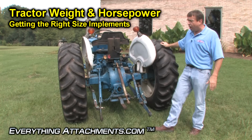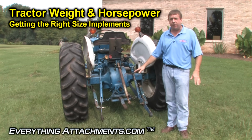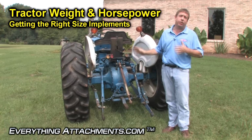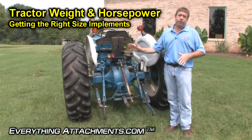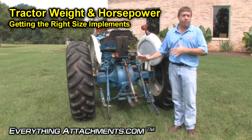As you go into the compact tractors, this is only a 40 horsepower tractor on the PTO, but if you look at the new tractors, sometimes you can find a tractor that weighs only half this much with that much horsepower. So the weight of a tractor is as important as sizing any implement as the power is.